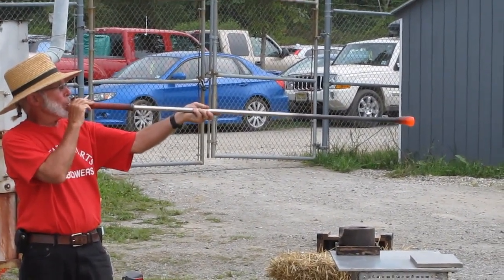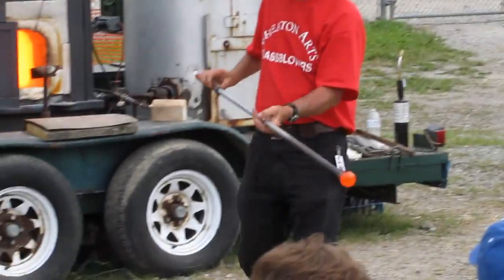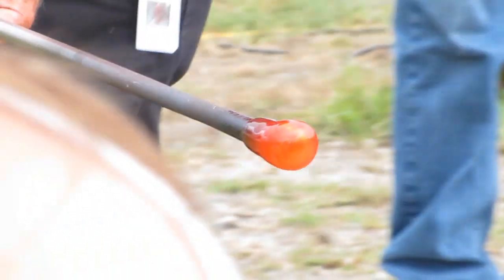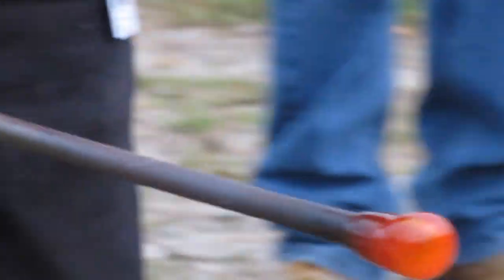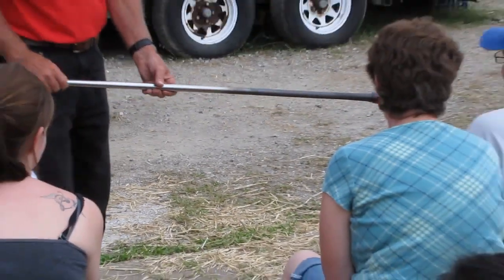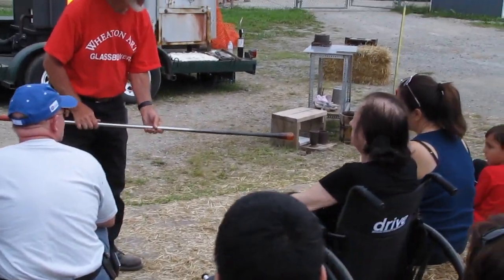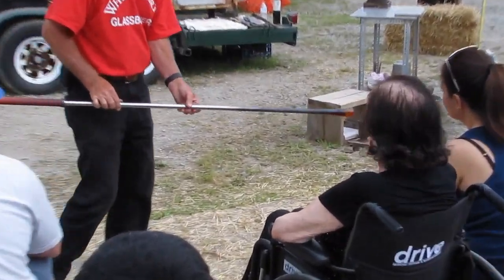If you don't let this happen, what's going to happen is when you go in and turn the rod in the hot glass, the friction would twist this bubble off and you'd have to start all over. Avoid the urge to reach out and touch that — that's an experience you'd probably never forget. In all the years that we've been doing this, folks, we have never been burned by hot glass, and neither has the public.